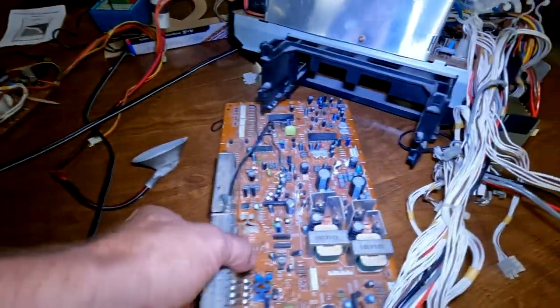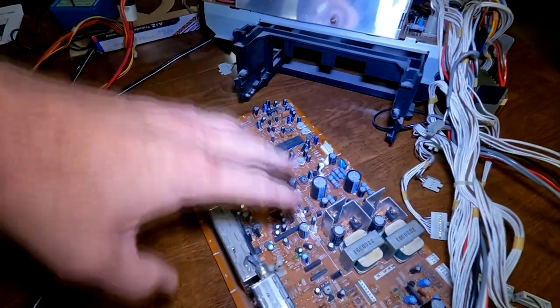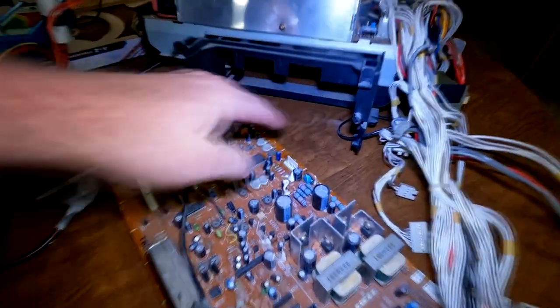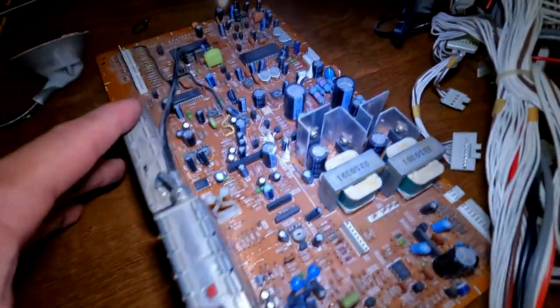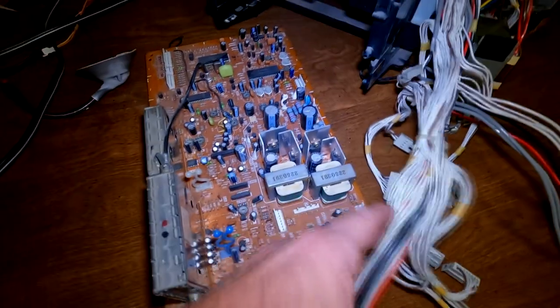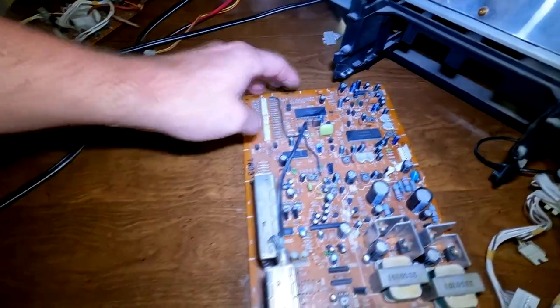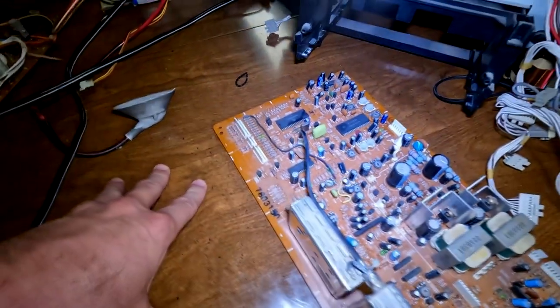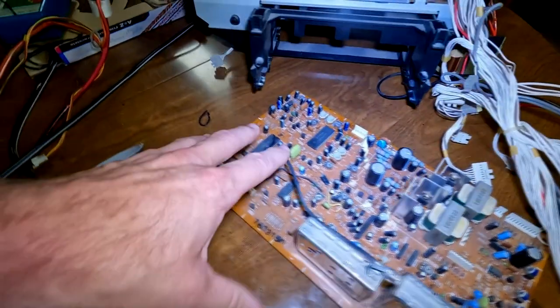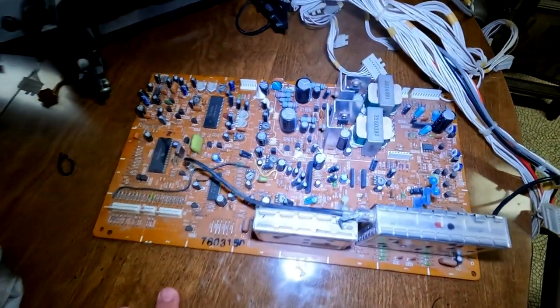And then under here, now this has already been broken out somewhat, but this board normally has 100 cables going into it, and it goes and slips under this board in that compartment right there. And this is mostly the tuning from the RF tuning and other controls. I'm imagining we're getting our picture control chips over here and our jungle chip probably. So this board is going under there, but this has a ton of capacitors on it.